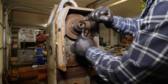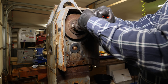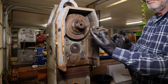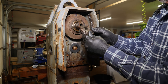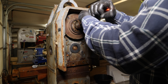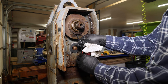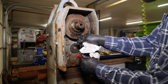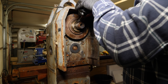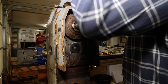There are quite a lot of snap rings on this machine, none of which managed to get me — but now that I've said that, one will get me when I put it back together. That's the clutch dog for engagement of the horizontal shaft so you can disengage or engage it. Here I'm removing a woodruff key with a pair of side cutters, just being careful not to apply too much pressure to the key so I don't mar it.